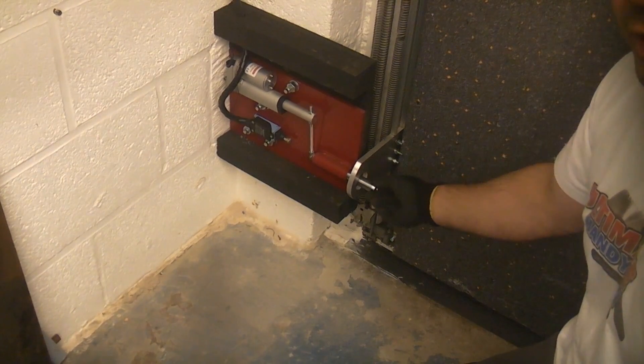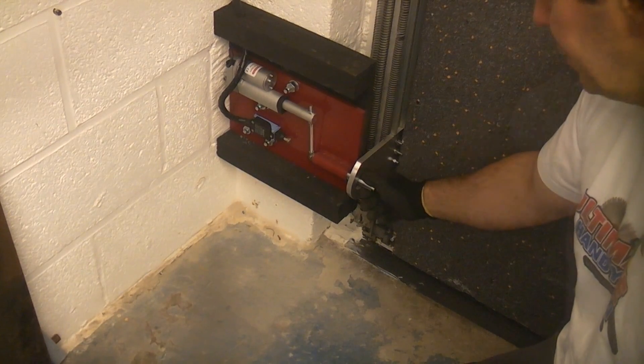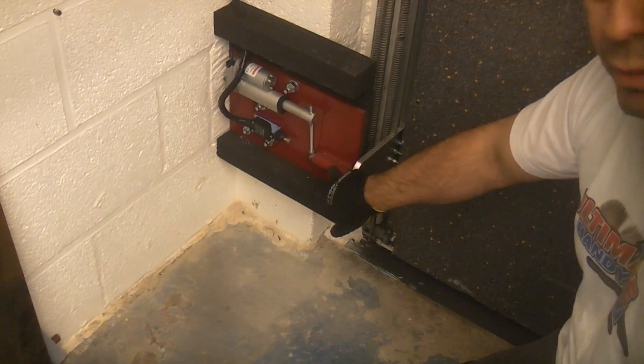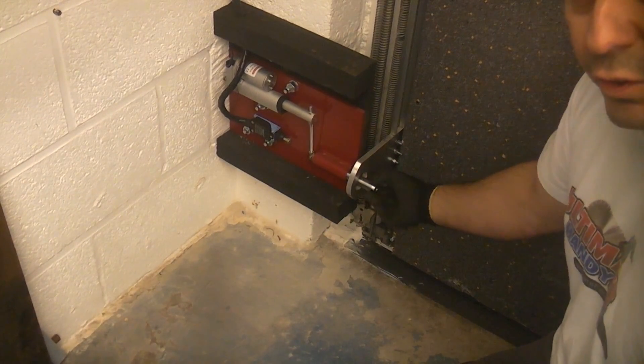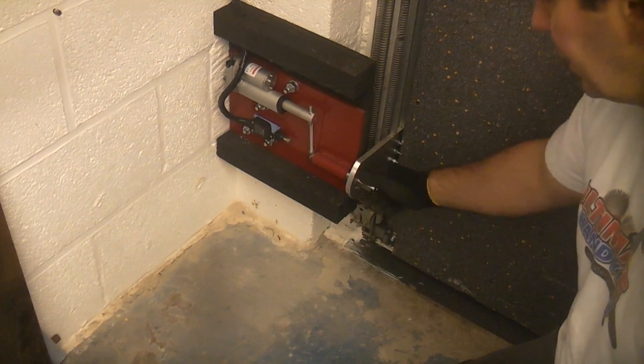The shoot bolt is actually made from an old hydraulic cylinder, so that is a steel shaft that has been chrome plated. There we have an 8mm thick steel plate and to that I have welded a piece of stainless steel pipe. The steel shaft is a good fit inside of the steel pipe so that slides in and out of there nicely.